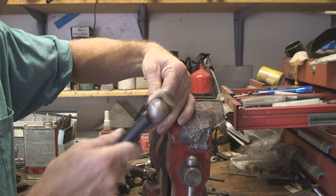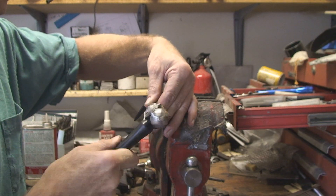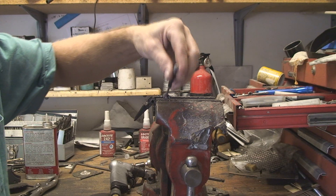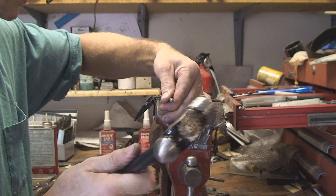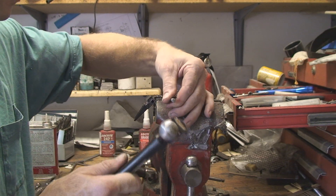Let's see if it's ready to move. These rivets come out easier than they do in an AK trunnion — for some reason AK rivets are installed a lot harder. I have to drill halfway through each side of the trunnion to even begin to get them to move. On a PSL they are coming out pretty easily. Well, that didn't take nearly as long as I thought.